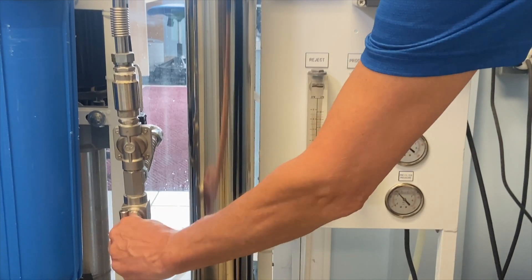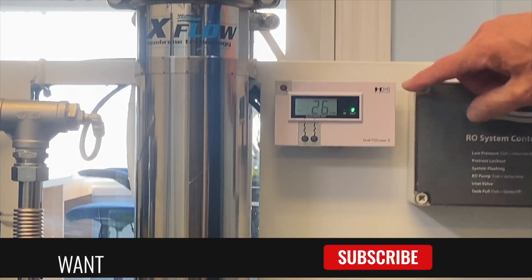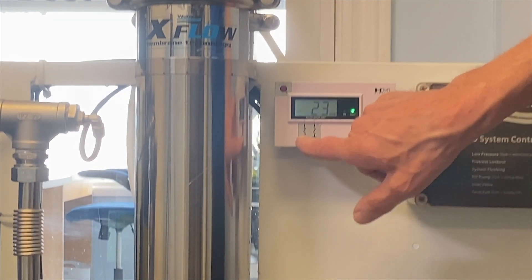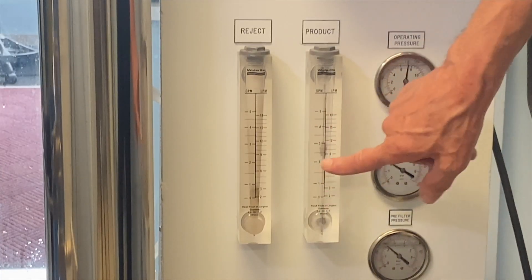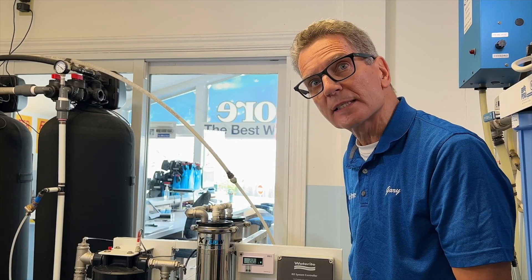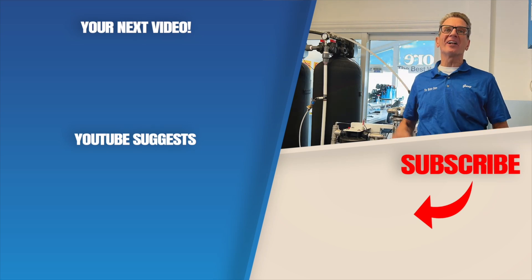You can check the TDS at this stage too. The outlet TDS is already lower than it was with the old membranes — the inlet TDS is still around 400 and the outlet TDS is around 22 parts per million and dropping. As fewer bubbles come through, the operating pressure rises. Make sure it doesn't exceed 130 PSI. The system ran for over an hour flushing the membrane. I've reconnected the line to the tank instead of the drain, and we can start filling the tank.